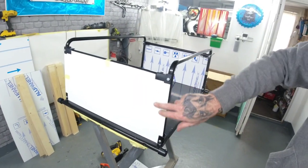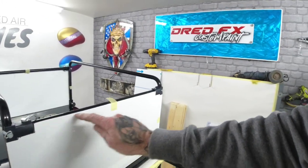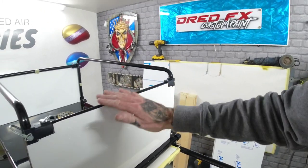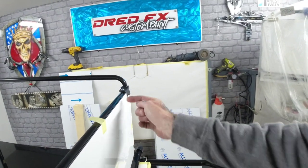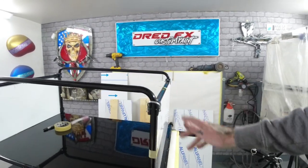In that first time lapse we've cut the front piece and the back piece - they're all nicely and intricately cut around these brackets and they fit nice and flush to the frame. These will be pre-drilled here, here and there, and they'll be self-tapped into the frame. All these edges will be sanded down - I've planed all the edges so they're not sharp in any way, but we'll give these a sand and round off the edges when we've done the other two.